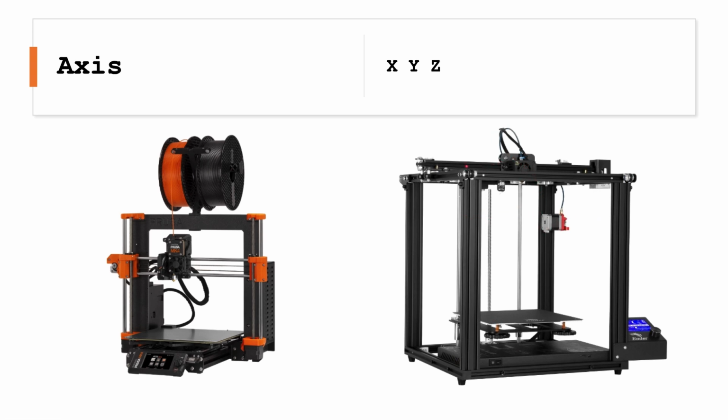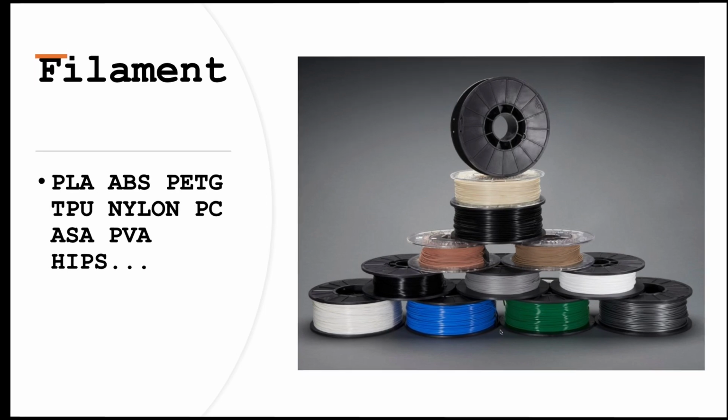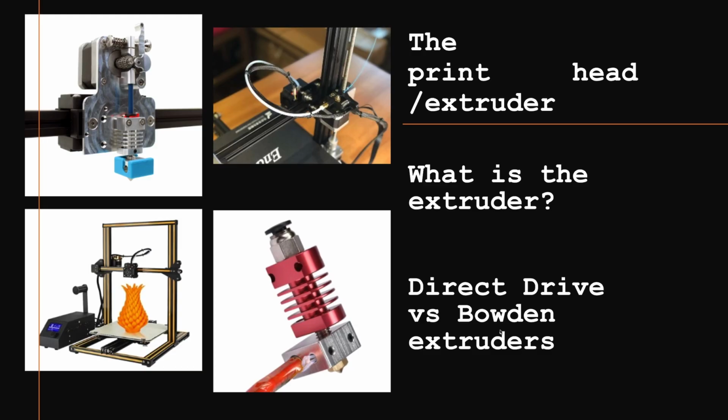On this printer, it's a lot different. This has the X and Y-axis at the top here moving back and forth, so the extruder still moves on the X-axis, but you can see here, this is one of the belts for the Y-axis. In the back here there's a motor, and it will move these belts, which are attached to this X-axis bar, which will move back and forth for the Y-axis, and then the bed will move up and down for the Z-axis.